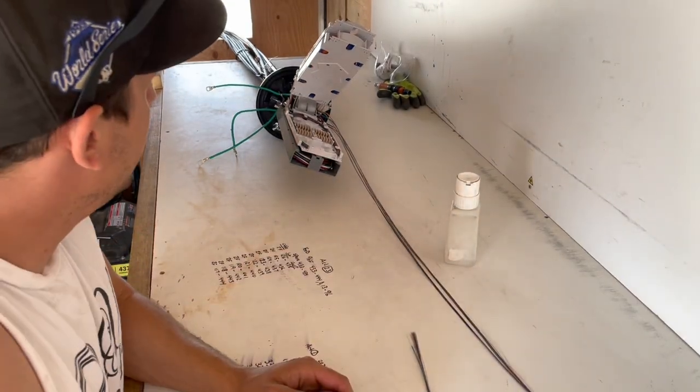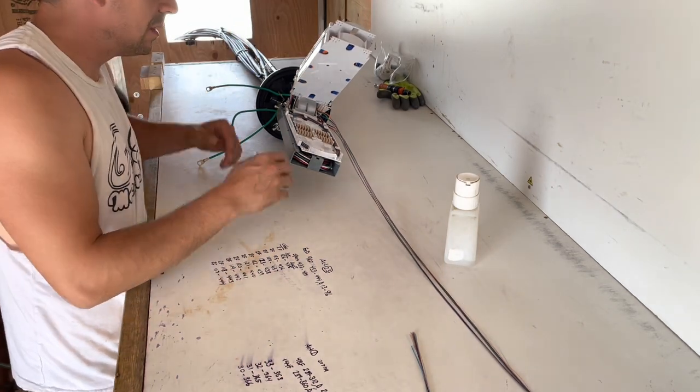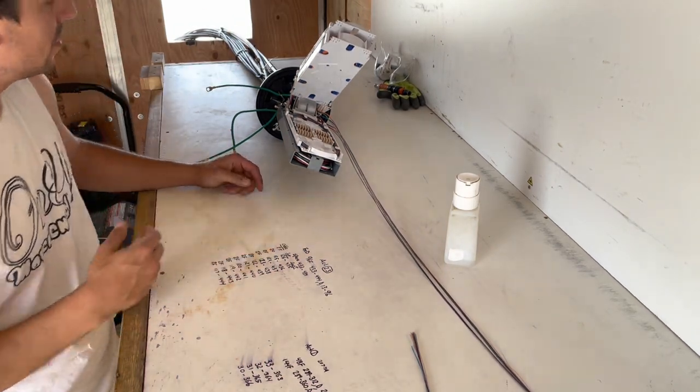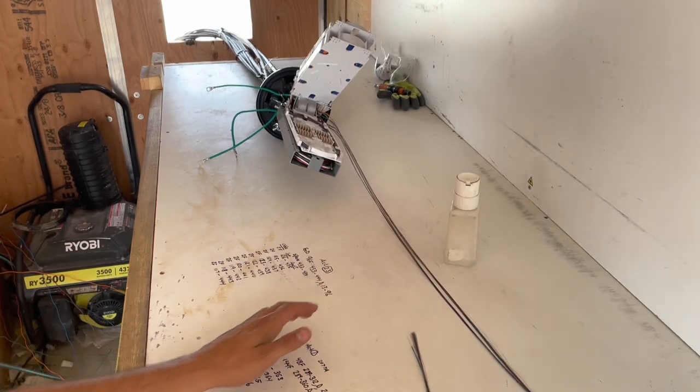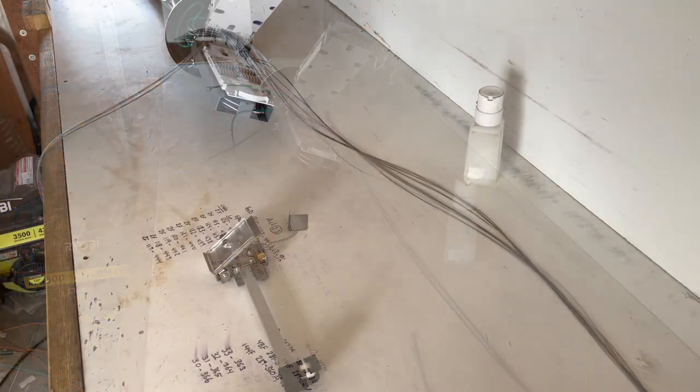Now we can just get to the ribbonizing. Ribbonizing 12, six each side. And splice six ribbons, quick 72 fibers. That should power this whole street and a little bit up the other street. Stay tuned for the ribbonizing.